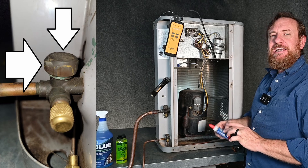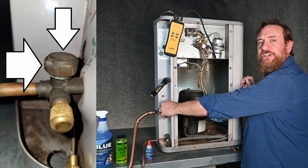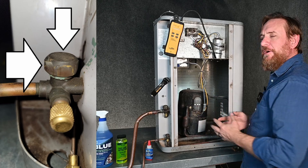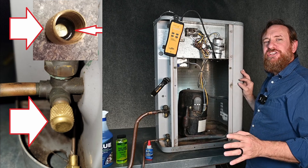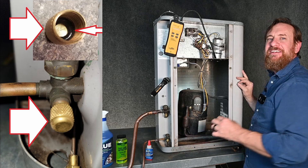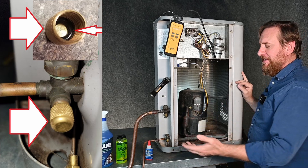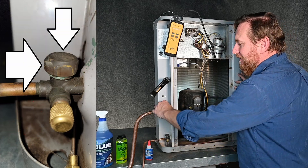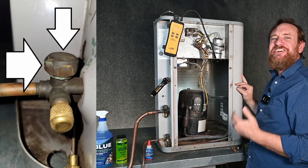This nylog is made of refrigerant oil — they have two different types, one for POE oil and one for mineral oil. By putting nylog on there, it makes a nice good seal that's easy to take on and put back off. They make another product that's a type of leak lock, and that product works in some applications I use it for. But whatever you do, do not use any kind of thread or leak lock on these valve caps, because the next person coming along is going to have a hard time getting these caps off, and it'll get up into the threads of their low-loss fittings and that's going to be a problem. I like the nylog because it seals better and allows me to take it off easier in the future.